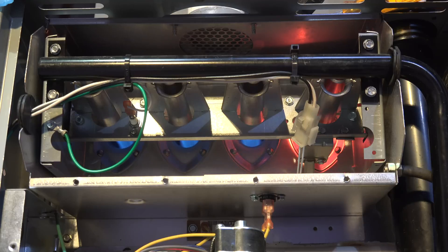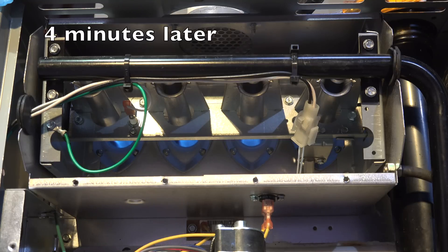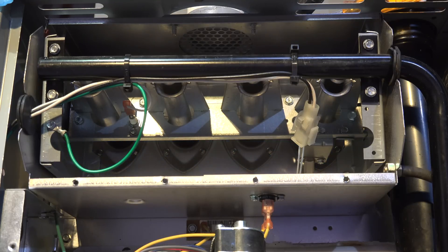We've got the fast blink down at the board. Burners are on now. I think this one's 30 seconds before the fan should come on, but the fan is not going to come on this time. This furnace is going to overheat and that limit switch is going to shut it off. It usually takes about two minutes on these things. This one is two-stage so it may take a little longer because it's on first stage. Okay - it has limited out.